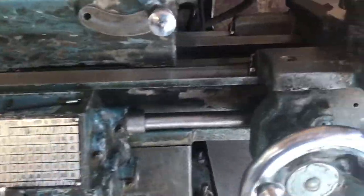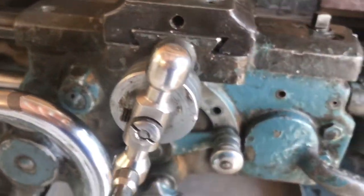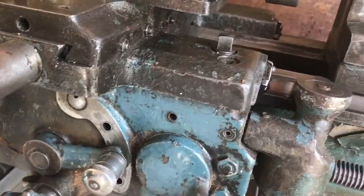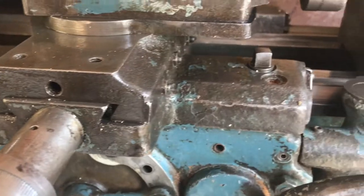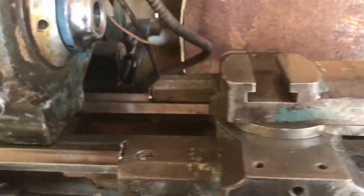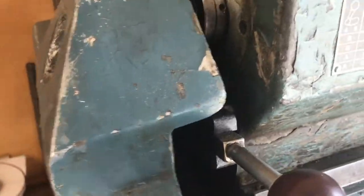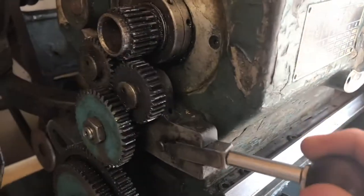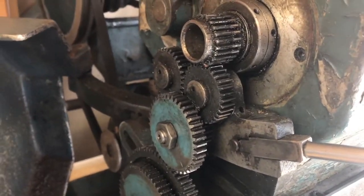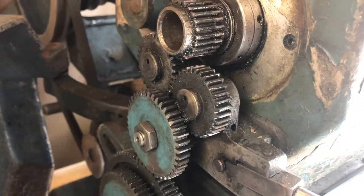On the bottom we have the lead screw, which drives the whole apron along if you want. By selecting the neutral position for this gear lever and lifting this up, a half nut comes up against the lead screw and connects the whole apron to it, so the lead screw can move the apron along the bed — backwards or forwards. Whether it goes backwards or forwards is determined by this lever: in a neutral position the lead screw is off; push the lever in and up for forwards motion, driving the tool towards the chuck; or in the opposite direction to move the tool away from the chuck.